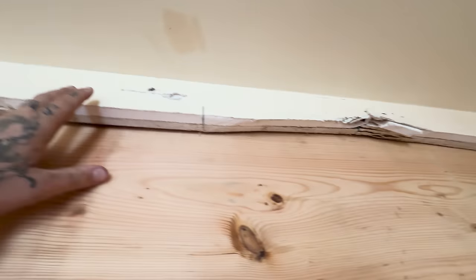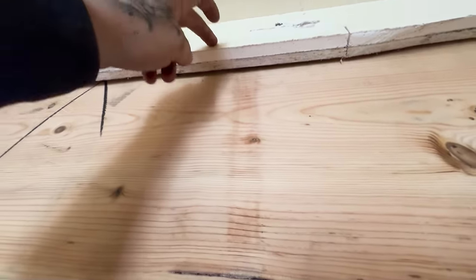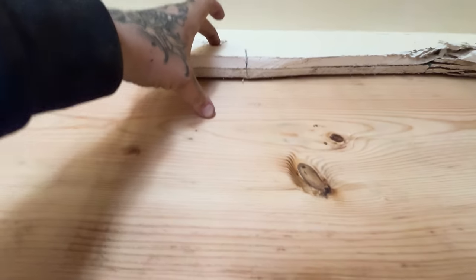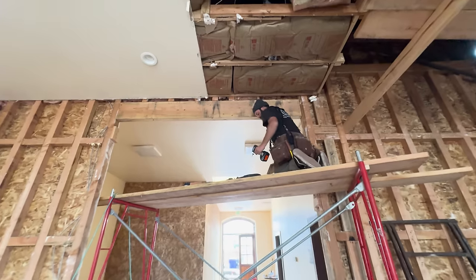This thing's in here now. We've got it tacked up over here. You can see that the sheathing here does hang down onto the beam. We decided to leave it rather than cutting it out. I am hoping that I can clean up that cut a little bit and get my nailing all the way along the top, and then I'll sheet from here down. LTP4 plate to plate connector there and be good to go. 4x here, 4x here, all the way through. Little Timberline door here. That looks so much better.